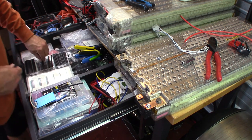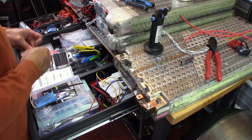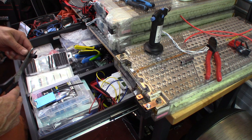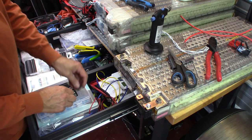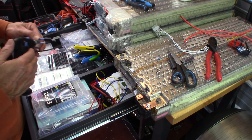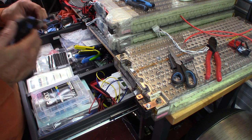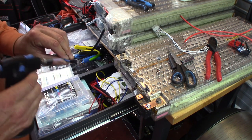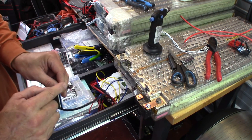Now, the heat shrink I like to use is this, and the reason for the marine heat shrink is it has, on the inside, a coating that melts and basically surrounds the whole thing, kind of like a hot glue. Over it, to it, and you'll notice as I heat it up, I just keep heating it. I don't know if you can see it or not, but right off the edges, right in here, is the hot glue that comes out.